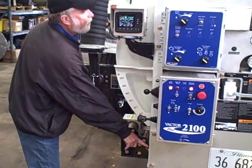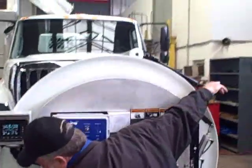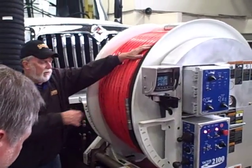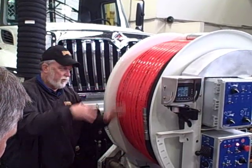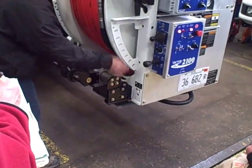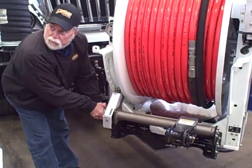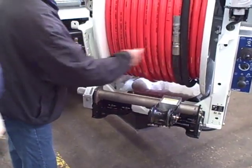This one here is for your pinch roller. It puts 70 PSI down against this roll. What that does is it keeps the reel from growing into a big mass — it pinches it down. So if you're hanging on to it and this stops, it'll just throw it out instead of damaging the bundle. It has an auto wind guide. If the hose is off to one side, you simply pull this out about a quarter inch, move it back in line, and it'll follow the hose and wind it back by itself.